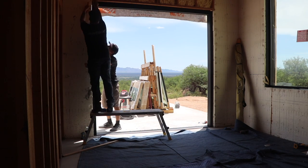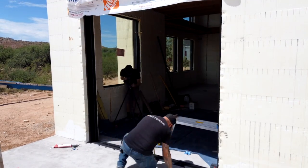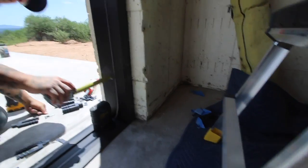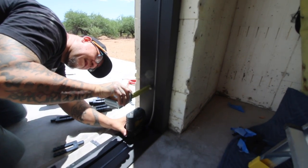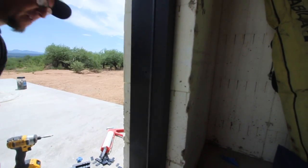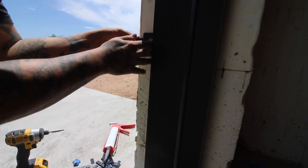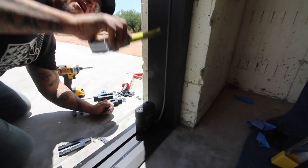You can see how easy it is to get the door plumb — just line up those laser lines, throw a couple shims in, and you know it's perfectly plumb without even putting a level on it. For getting the sides of the door perfectly plumb, Ramon set up his laser to get an even measurement at the first screw, then checked each subsequent screw to see how far it needed to come in or go out. He used shims to make up the difference, double-checked with the laser, and then screwed it down.